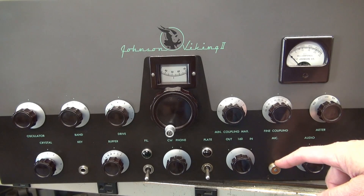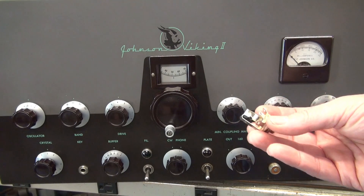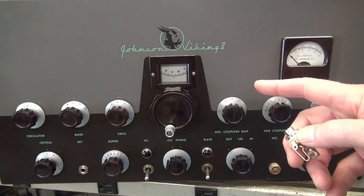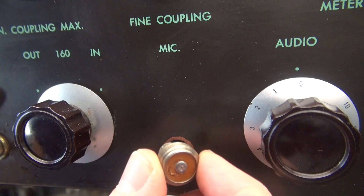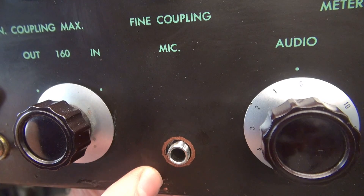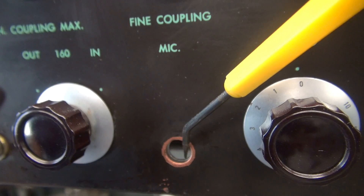You could also use one of these TRS type jacks - this is a Switchcraft jack, actually for stereo connections. You've got two connections and your ground, so you'd have push-to-talk on one, audio on the other, and then ground. This one does not require any drilling of the front panel. You can remove the stock jack and one of the TRS style will go in its place fairly easily. There's enough threads poking out where you can get the nut on there without having to pull the front panel. But there is one issue to be aware of.